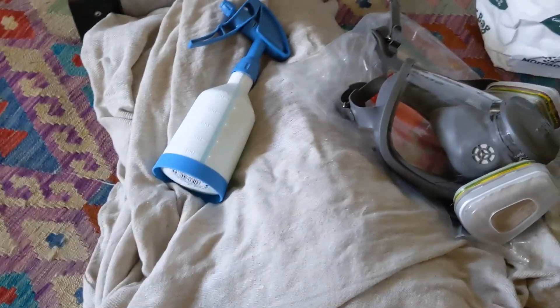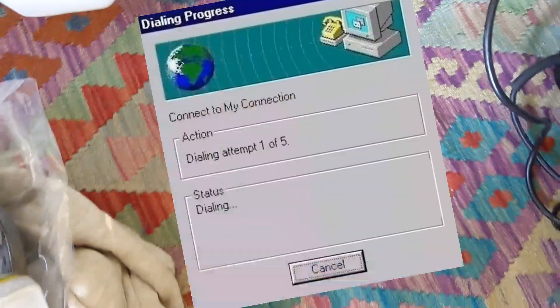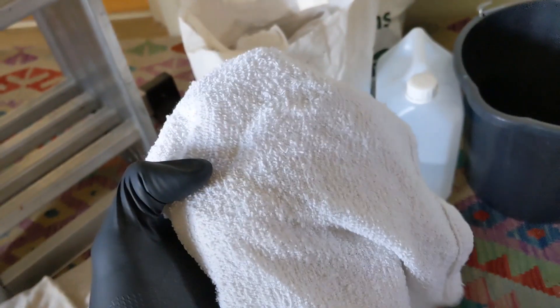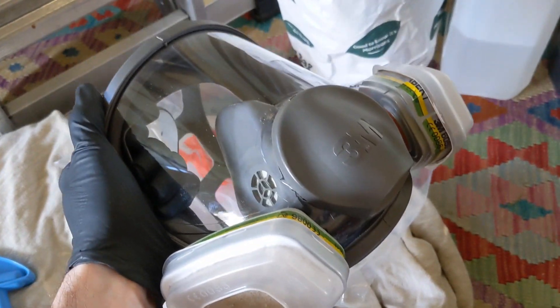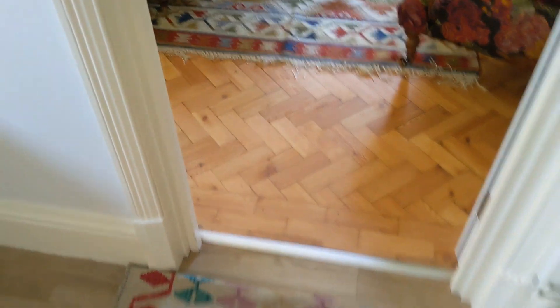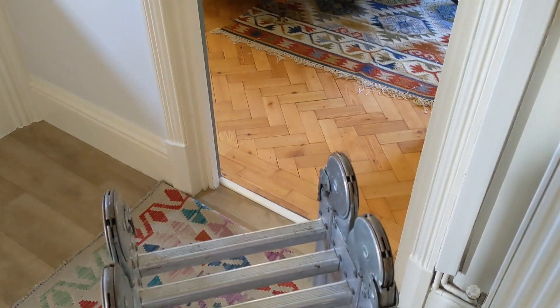The second thing you're going to need is a dust sheet to put on the floor, because property protection is key. You're going to need a fine mist spray bottle, and you're also going to need our secret formula solvent to put in that spray bottle to spray on the fabric once you've vacuumed it. Then you're going to need to towel that off with clean terry towels to pick up the soiling. I like to wear a full face respirator because you're using solvents — you want to be thinking of your lungs and health and safety. You're also going to need a pair of ladders — another reason I like the dust sheet is it prevents ladders from scratching floors, and if you drop any solvent it absorbs into the dust sheet rather than damaging carpets or wooden floors.